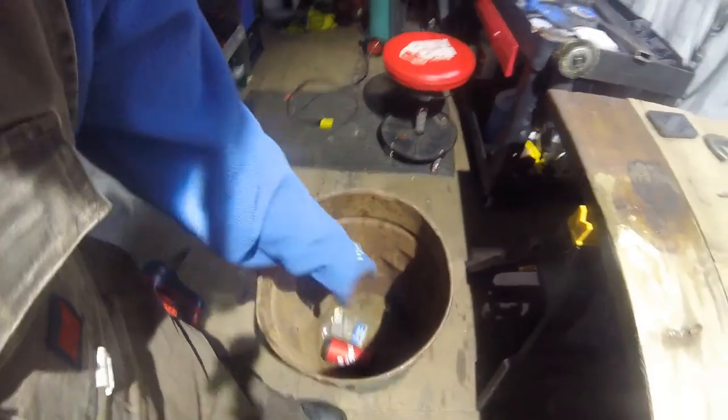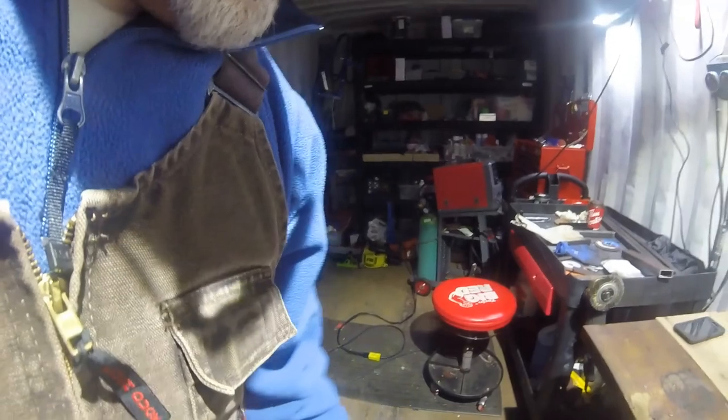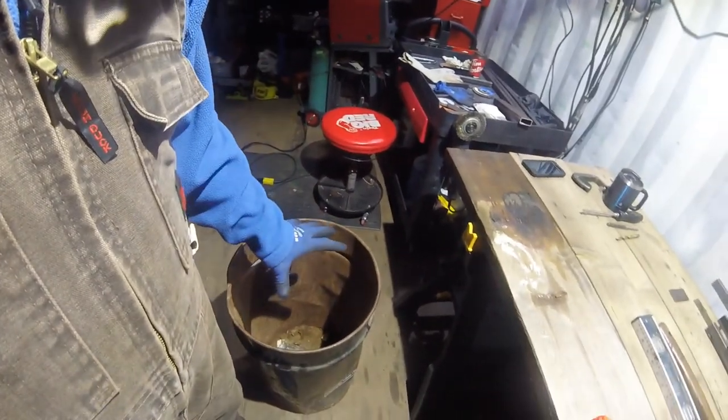I'm going to put a baffle, some kind of grate on the bottom, ash cleaner. And I want a secondary burn vent, probably coming in from the back. Slide a vent open with a pipe coming up to just under the baffle, before the end of the baffle, to energize that fire, give you the second burn, warm up that air. I've been reading a lot on that, and I think that's what I'm going to do today.